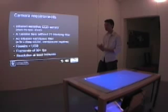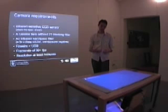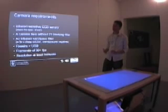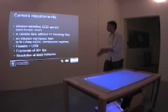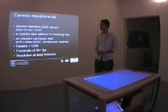If you have the money, I would prefer to use a firewire camera, just because of the latency. Since we're creating a technique where direct interaction is very important, you want to keep latency as low as possible. USB cameras often buffer more images, which introduces latency, so a firewire camera would be preferred.